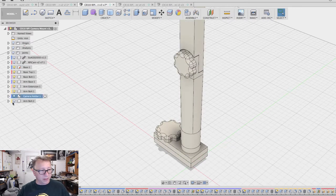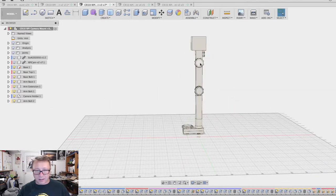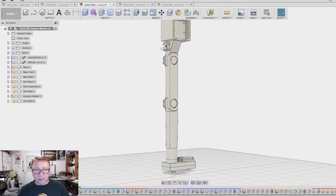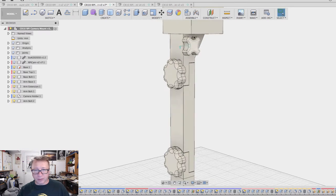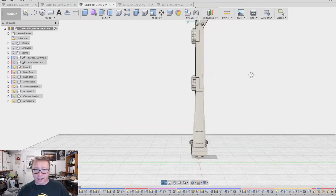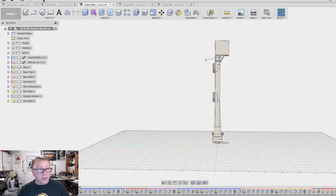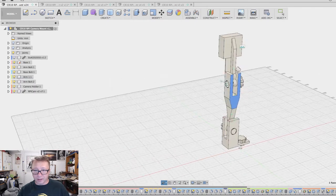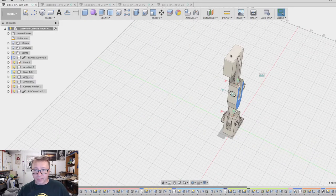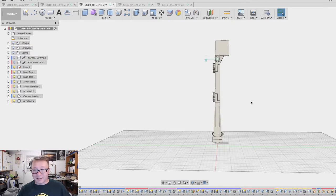Again, a very nearly identical design. I made the bolts a little bit bigger. I added a little bolt for the swivel joint to hold it into place. The bolt design is a little bit different — it's only got four handles instead of a whole bunch, which makes it a lot easier to grab because it's a lot smaller. For this design, you can print it flat on this face here, and then there's no need for supports. Some parts do still need supports because of the little arm in the back — either across the back or on the inside. I chose to print it from the bottom, which meant I didn't need supports on the back but did need supports all on the inside, which made it a colossal pain to clean up.